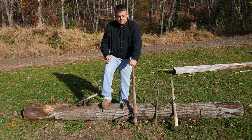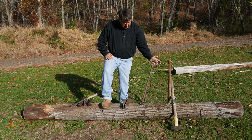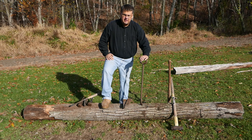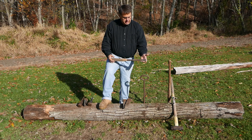The tools that you need for splitting rails are very simple: a sledgehammer and a few wedges. I have also included today a cant hook for turning the log over and positioning it. I have a barking spud for peeling bark — this was a common tool found in most farms in Appalachia. I also have a chisel used to split off the fibers that connect one rail to the other after I split the majority of it. It simplifies the work considerably.